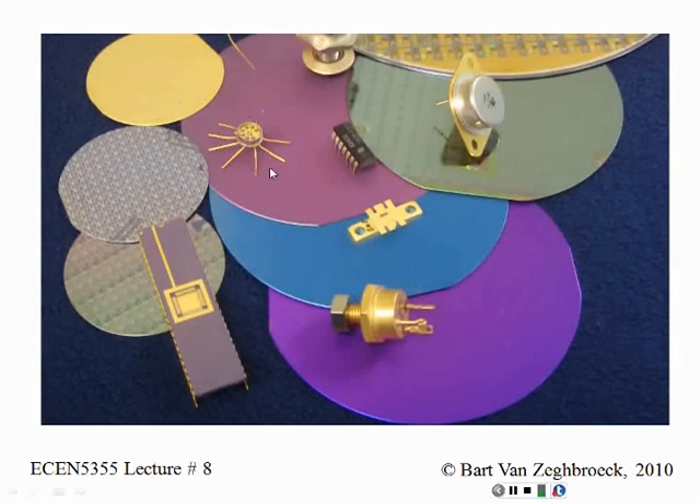An example would be this little one — it would maybe go up to a watt, and then you can attach a little heat sink to it that might improve it a little. These transistors are typically rated for up to 50 watts of power dissipation. And then once you get into — this looks like a thyristor — these you bolt onto a bigger heat sink. Typically these have a higher current drive, though I don't know the exact rating on that one.